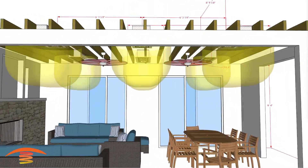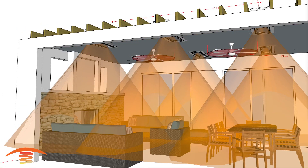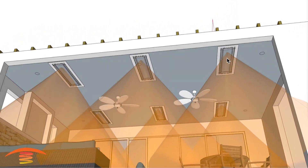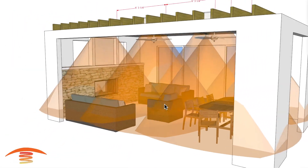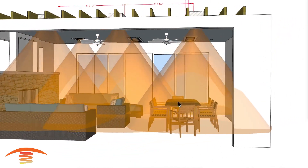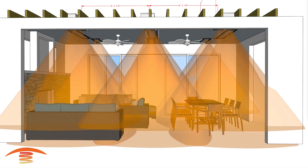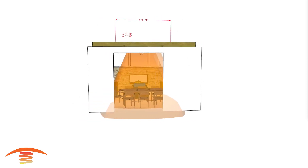Let's go ahead and look at the footprint of heat. I'll turn the top back on. You can see the footprint of heat is fairly decent. These are 4,000-watt dual element units — I think they're 39 inches long plus the flush mount kit itself. I would do something like this in order to heat up this whole entire space uniformly if this was an ideal situation.